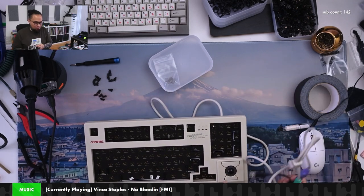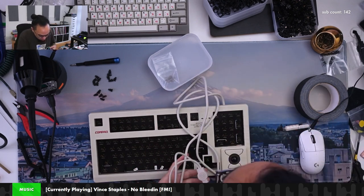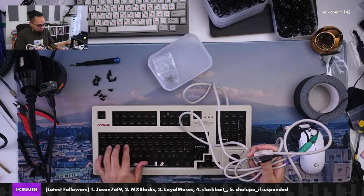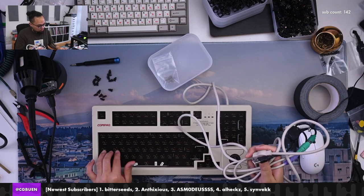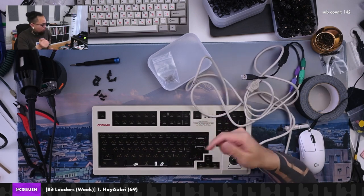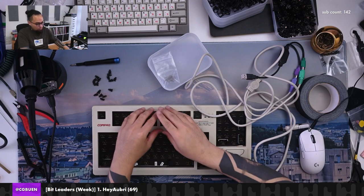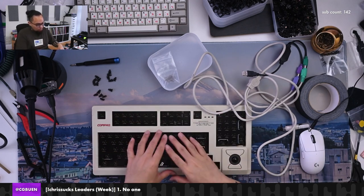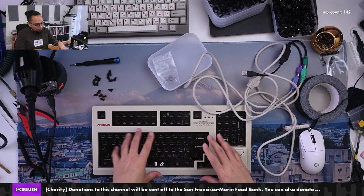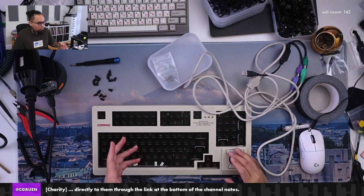Alright, so where have we landed? One, the stabilizers are tuned. Two, these jumper wires have all been soldered in, as they used to be inside of the individual switches. But the problem is, in order for us to use 3-pin switches on this, we need these working plates. And I have 3 working plates and 1 bad one. So the one bad one, I need to get redone, because the only other option is to use 5-pin switches, which I don't have spare 5-pin bottoms that I want to use for a joke build.